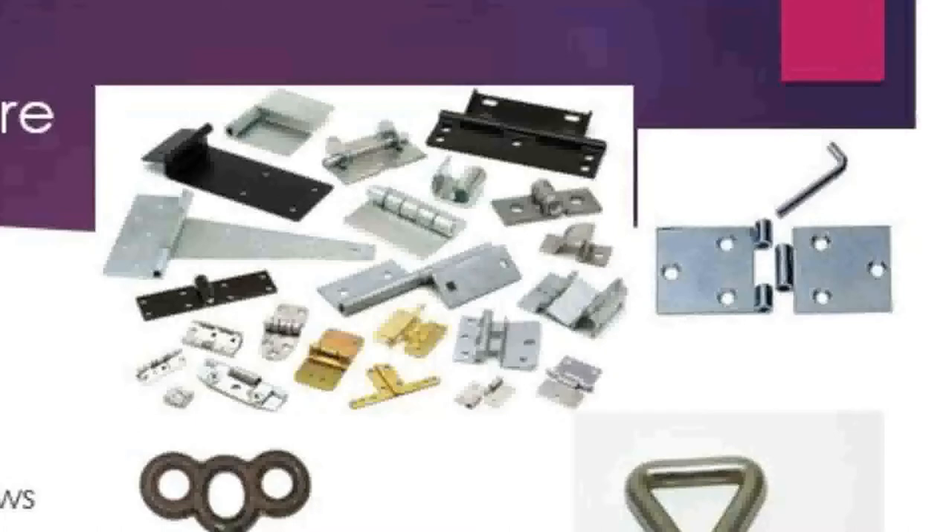We also use what are called loose pin hinges, which is this other image to the right. You can see that the pin is out of those two hinge pieces — that is the shape and general look of the standard loose pin hinge that we will use in a set. It allows us to lock two pieces of scenery together quickly, say two wagons that we have to roll on stage separately but need to be connected together for the show. We'll roll them on stage separately, line up the two pieces of the hinge, put a pin in, and those two pieces are locked together. We can also put half on the stage and half on a piece of scenery so that we can slide that pin in when we put the scenery on, locking it to the floor so it can't slide.